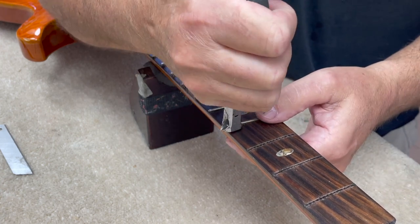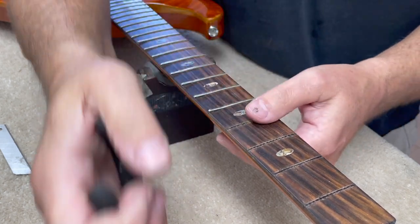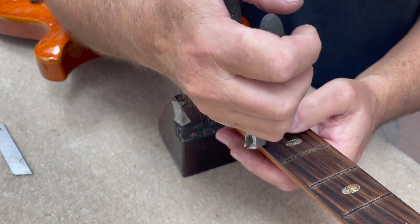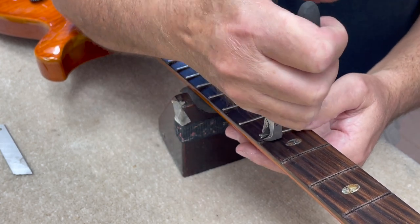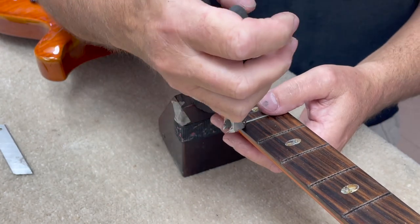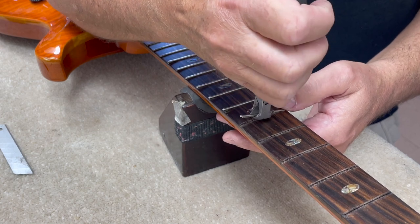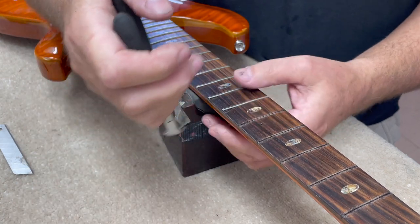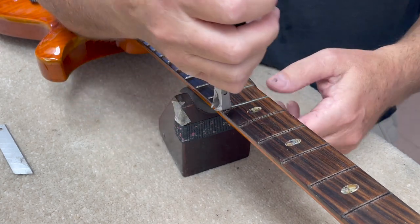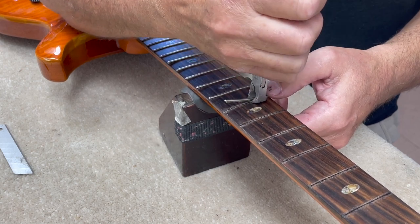The downside is it leaves you with end gaps if you cut the fret short. If you let the tang go right to the edge, then you can sand the metal flush with everything else, but you also still tend to take some of the finish off the edge, because it has to eventually run up against the finish, otherwise it won't be flush. So that's the downside of fretting to the end and using the fret beveling block. But really, you can't get away without using that block if you want a sharply finished inline set of frets.